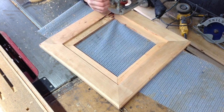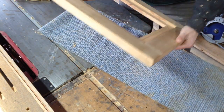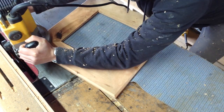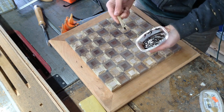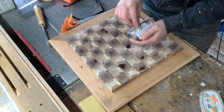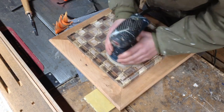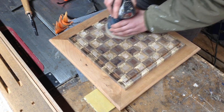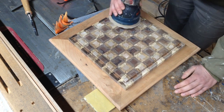To finish up the frame I decided to chamfer the top and bottom edges — I wanted a very subtle detail design. The guy I mentioned makes some really decorative frames, but I wanted something very simple for this because the board itself is already very detailed. I did also chamfer the inside edge of the frame, though I don't think I show it. To fill the little holes I mixed up some epoxy with some wood putty and added a little bit of stain to make it darker, then went through and did the brown spots. For the lighter spots I had maple sawdust, so I just used maple. Once it dried I did the pieces on the bottom as well because there's a peak hole on the bottom — I didn't want you to be able to see gaps in that either.